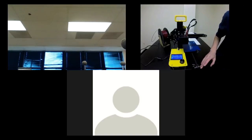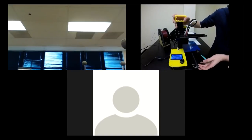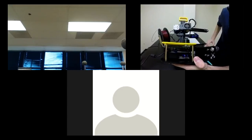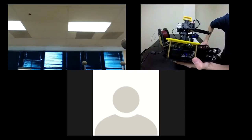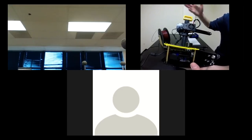After the mechanical overview, a participant notices a micro USB port on the printer and asks if you can print directly to it. Michael confirms you can plug a computer directly in, but the problem is if the laptop goes to sleep, turns off, or disconnects in any way, the printer will stop. That's why SD cards are preferred — they're foolproof and ensure continuous printing.